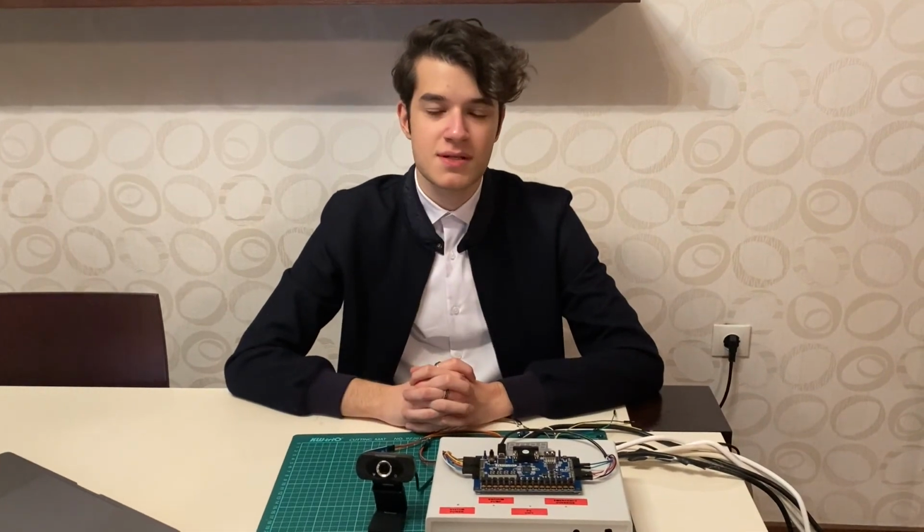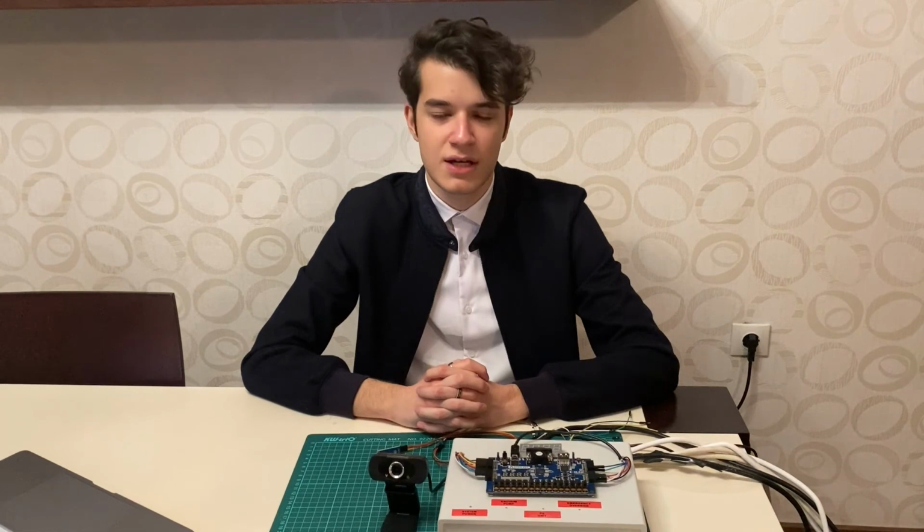The fourth module is the state machine, which is the heart of the system. Using 4 cases in total, I was able to define conditions such as error or breakdown, and I was able to conceptualize what my system has to do and implement it in the VHDL code. At the same time, within this module, there's a counter. And with the help of the 7-segment display module, I was able to print the results of those counters for the operator to see. So this is my project.